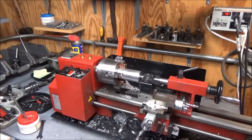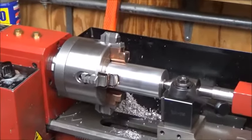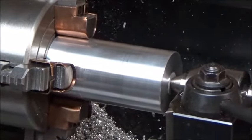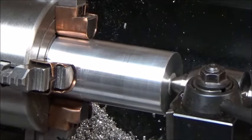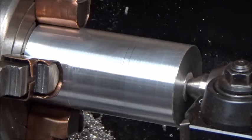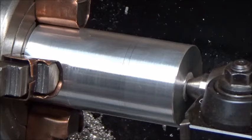I've set a piece of material up here on the mini lathe this morning. What I did was I machined off both ends of it and cleaned up the surface. This has got a little more to come off of it than the displacer cylinder had. I can't remember exactly what size this material is, but it's a pretty good size chunk of bar stock. The displacer I think I started off with two and a quarter and only had to machine it down to two and an eighth. This one I think I'm starting off with a piece that's about an inch and three quarters in diameter, and I've got to machine it down to almost a little over an inch and a half.